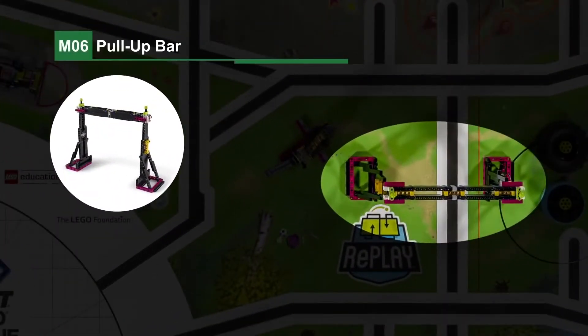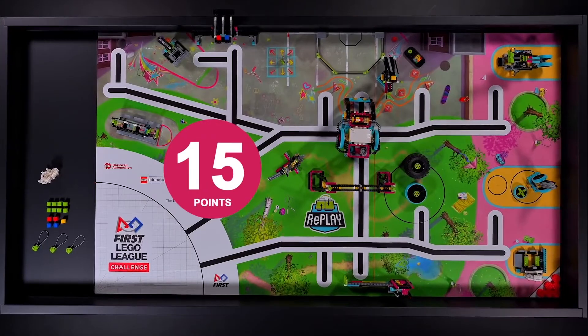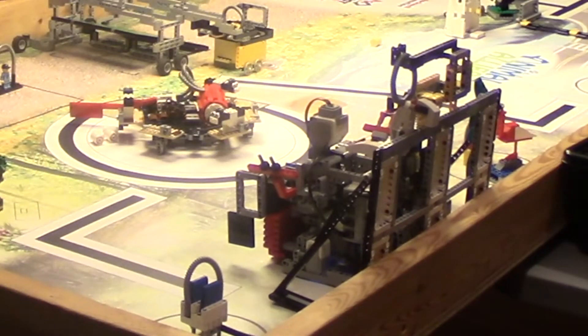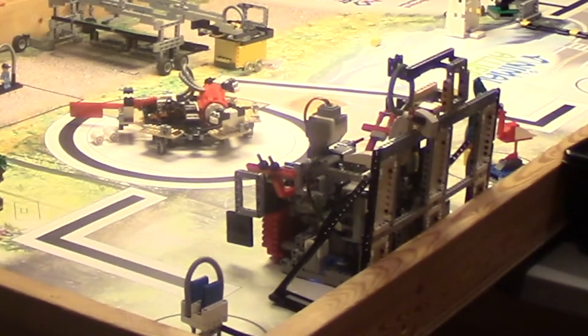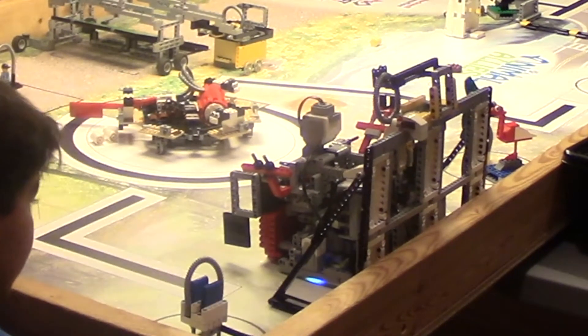Hanging on a pull-up bar is difficult because you have to hang a heavy robot. Some ways of solving this are low gear ratios, pneumatics, or worm gears, such as what we used in the Animal Allies Robot game. As you can see here in this clip, the worm gear slowly pulls up the robot and holds it in place.